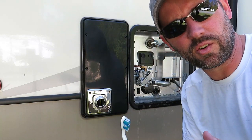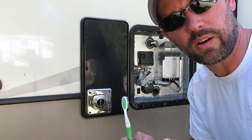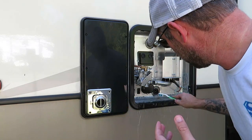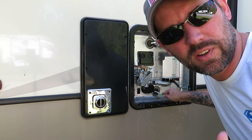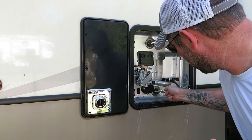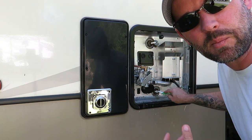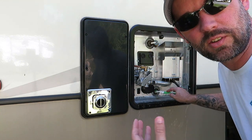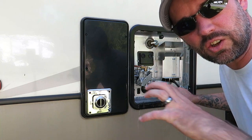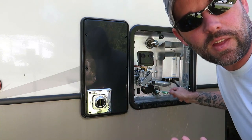While the water is still draining and you have some pressure, take an old toothbrush and scrub around the edges to remove old plumber's tape and corrosion. Do this while the water is still coming out so the pressure pushes that loosened debris out — if you scrub after the water is fully expelled, there's no pressure left to flush the corrosion out.